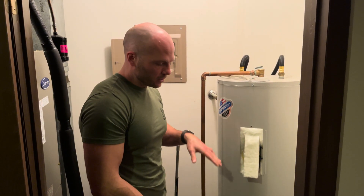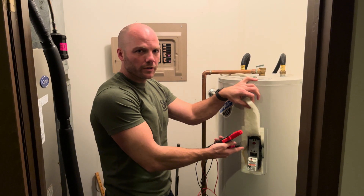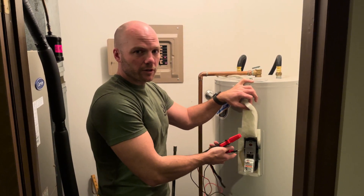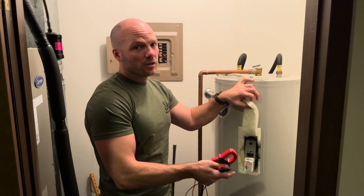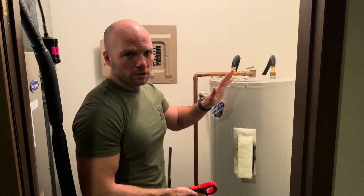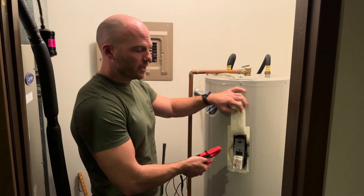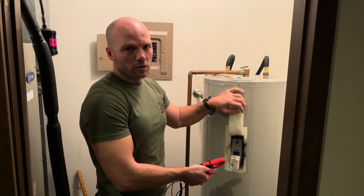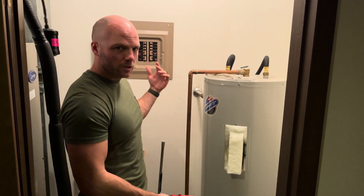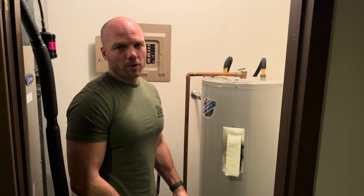So that's how you test the element and whether the thermostat is getting power to the element, and that's how you reset a water heater thermostat with the red button. When one isn't working, first check the reset — if it's popped out, push it back in. Maybe it was a fluke, a power surge, or something caused it to pop out. If it trips off again in a day or two then it's probably a problem with the thermostat and it'll need to be replaced. We'll put up a video on how to replace the thermostat. For now, turn the power back off, put the panels back on, and you should be able to determine what problem you're having.